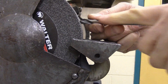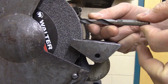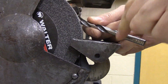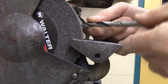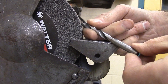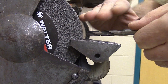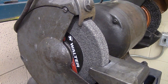Make sure that you are horizontal with the table. And then with the thing going, I just drop this end as it's going. And once you've got it sharpened, roll it around on your fingers, do the other side. And with this horizontal, and the cutting edge horizontal, and the shank lined up with that corner, it should work, kind of like this.